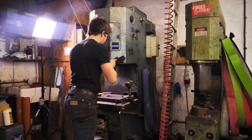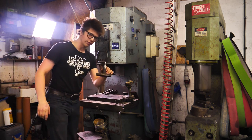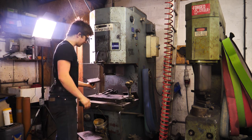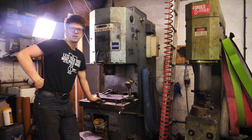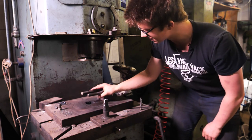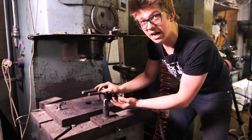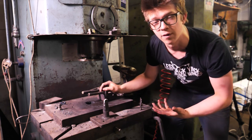I'm going to be working on my 25-ton hydraulic press today. I just have to install this punch under here and then I have to get a stripper — not that kind of stripper, this kind of stripper — and that's going to sit there so that when the punch goes down and it sticks, you then lift it back up and the whole piece of steel falls off.